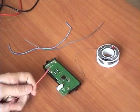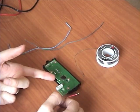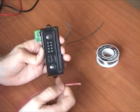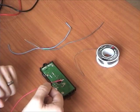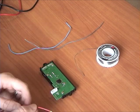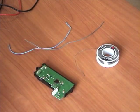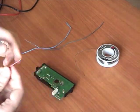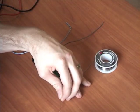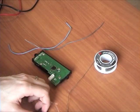The next thing I'm going to do is get my wires ready. I don't actually remember which one is the turbo and which one is home, so we're just going to do both and figure it out with the multimeter later. And as I said, we'll do the ground down here. To prepare this wire, about a quarter of an inch sticking out is enough. I'm going to put some solder on the wire just to get it ready. If you do care about your table, put down something like the inside of a pie pan — something metal to protect it, since metal won't burn.